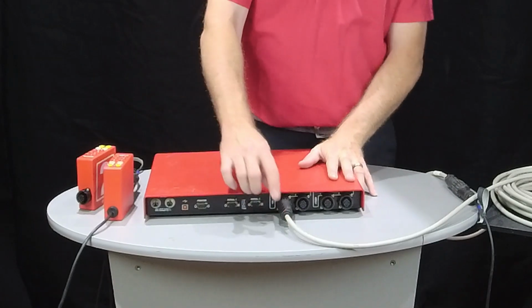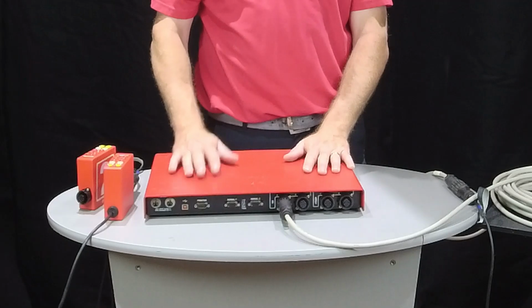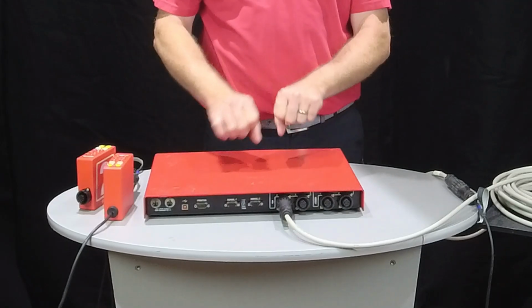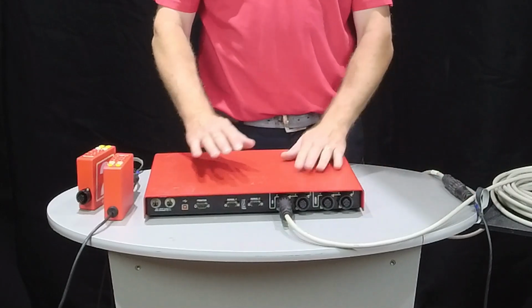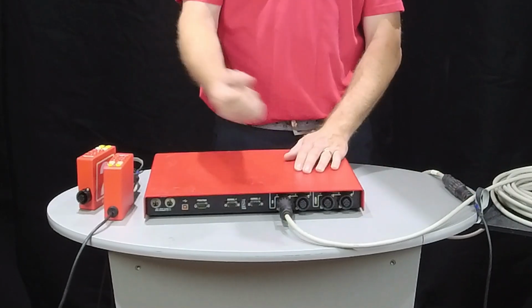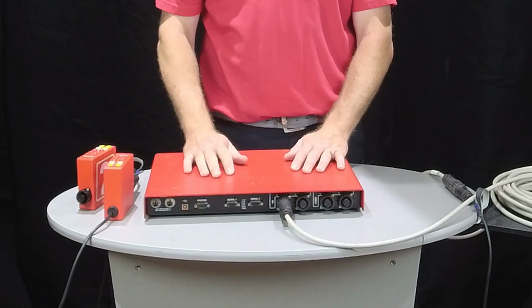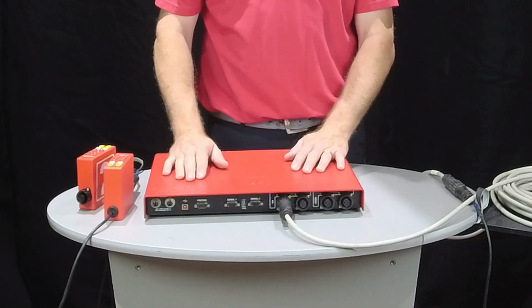These Tuchel plugs are a little different than what we normally see, but they are 100% waterproof, and they're locking connectors. So when they're sitting in a puddle of water on the pool deck, or somebody trips on the cable, they're not going to come out accidentally. They're not going to get loose with vibrations and things like that. It's a very industrial plug that is proper for this environment.